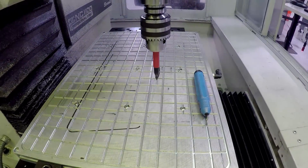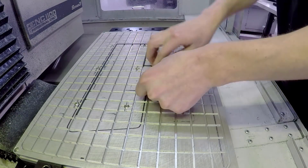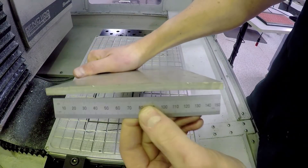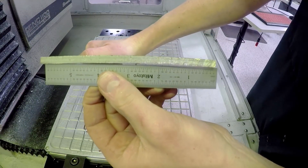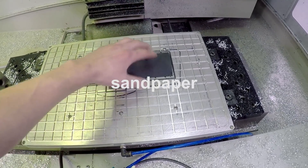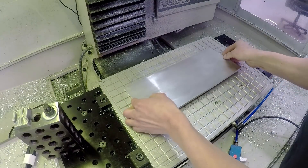On this project, we used a Sharpie in the spindle to lay out where the final part would be. That way we kept the gasket inside that profile while also maintaining the maximum surface area inside the gasket — because remember, it's only the gasketed area that counts towards that 14 pounds per square inch. Then we did another classic vacuum trick: putting a piece of sandpaper between the vacuum chuck and your part.